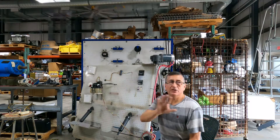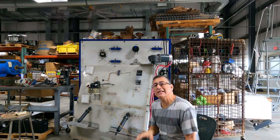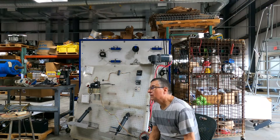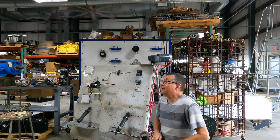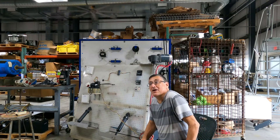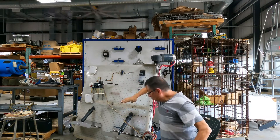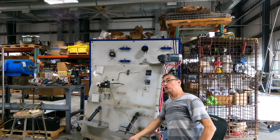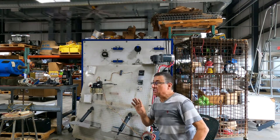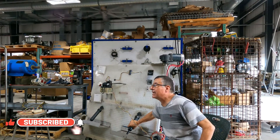In what case is the problem on the solenoid? If this flap is doing nothing, the solenoid never opened. Because when the solenoid opens, it allows the fluid to go out to put the flap down, or go in to retract the flap. If the solenoid is not open, I don't have movement — it doesn't matter if the motor is moving.